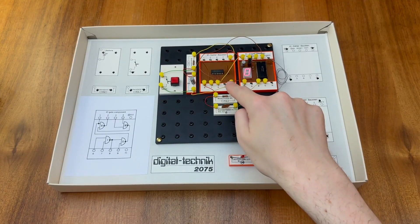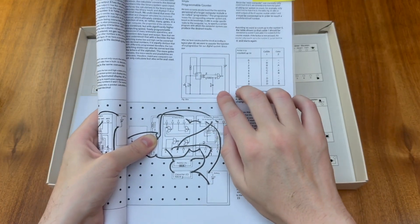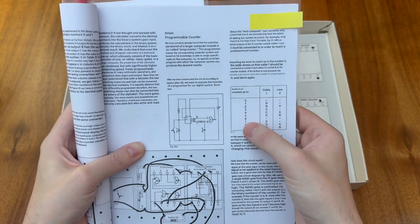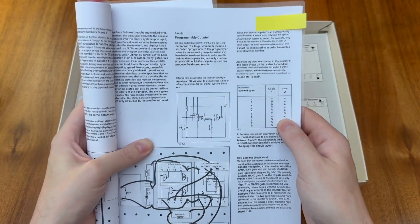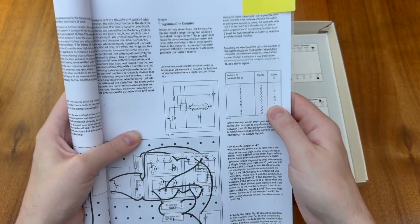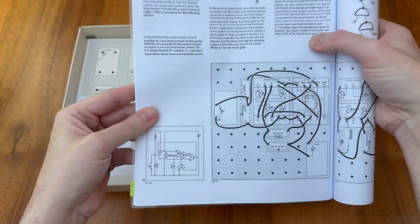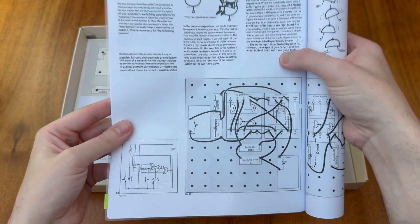You might wonder why there's an additional resistor and capacitor for input 6 on our NAND gate. The manual explains this has been inserted to alleviate any gate noise or switching delays that might occur when using our counter IC. The manual provides a programming solution for all maximum values except 6, because if we were looking for a maximum value of 6 we're actually checking for a 7 — and 7 is a special case because the output value is 0111, which would require 3 inputs on our NAND gates, but each of our NAND gates only has 2 inputs. We can of course combine the individual NAND gates inside the IC to detect this value and reset the counter, and that's explored in the very next experiment.